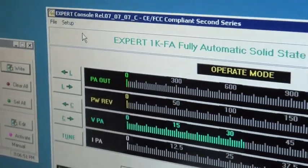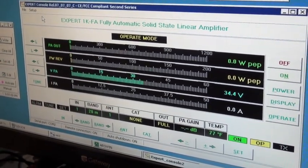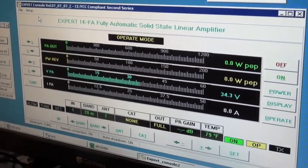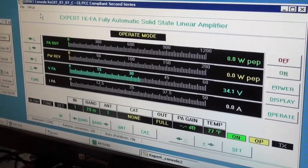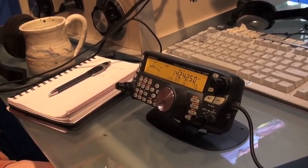And then, to the right, we have of course the newest addition to the shack — the virtual control panel for the SPE Expert one-kilowatt fully automatic linear amplifier. It gives me one kilowatt on six meters through 160 with a built-in tuner, and it will also auto RF sense and follow the radio around so that, basically, once you have your antenna selected correctly, it will move bands. The beauty of this is that it has four coaxial connectors on the back of the amplifier — you can map any of the four ports to any of the bands that you want.